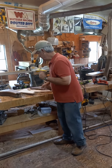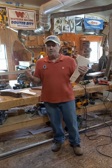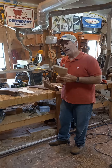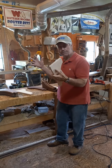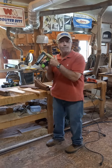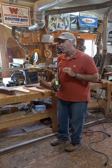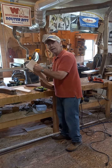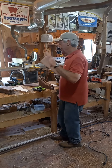To make the middle pieces, I started out by attaching the step-back pattern to a piece of walnut that I cut pretty close with a jigsaw. Once I had flush trimmed that piece of walnut to match this pattern, I pried the pattern off. What I'm doing every time is using about an inch-and-three-sixteenths to three-eighths headless pins — they make a very small hole but about three of them will keep it from moving. You just shoot through the pattern into the piece of walnut, then pry it apart and wiggle those headless pins back and forth until they break off.